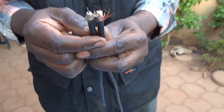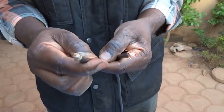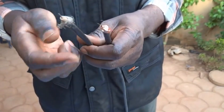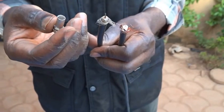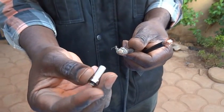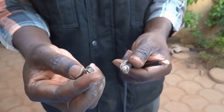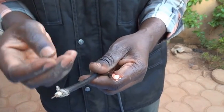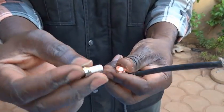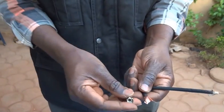Some cables resist very well under sunshine, so the external coating is very resistant. Others are less resistant, and we have experienced some damages with those. It's also good to know that some cables have an external diameter that is too big to receive the F connector, making it difficult to fit after preparation. Others have an external diameter that is too small, and then your F connector will have a floating wire and the connection will not be good with your devices.